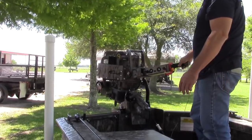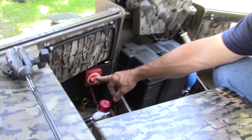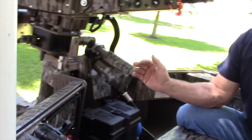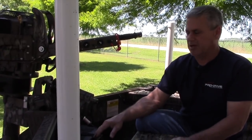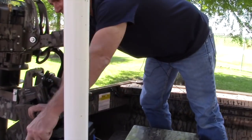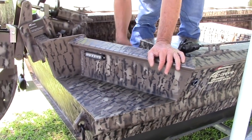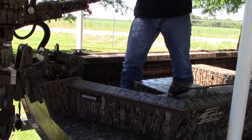You'll notice the angle on the back here — we have a battery disconnect and the batteries are here now. The reason we changed up the hunt deck a little bit is because people were having a lot of trouble reaching the drain plug or working on their bilge pumps. Now with this angle back here, you still have your step to step in and out of the boat or for the dog, but you have a lot easier access to your floor right here.